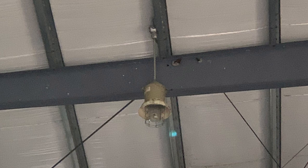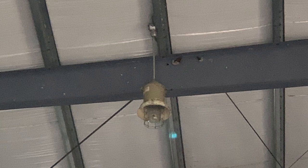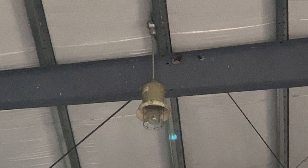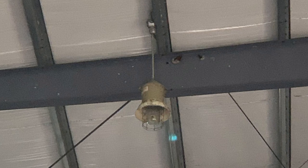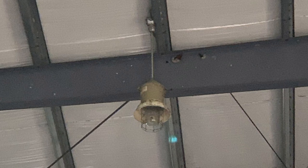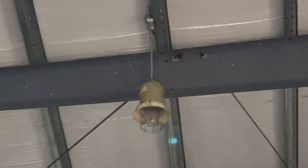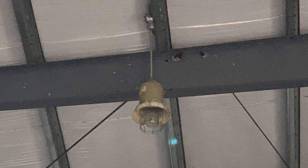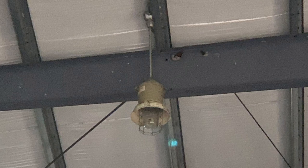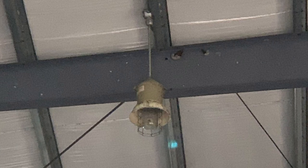There's a cage inside and an outer ring, so I had to take both of those off — those are usually full of bird poop or spider nests, cobwebs, all gross. Then I had to unscrew the light bulb, but because it had been sitting there so long it was extremely hard to get off. On the last light my co-worker brought over a belt wrench — basically a belt you wrap around the bulb and pull — and it came right loose.